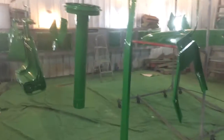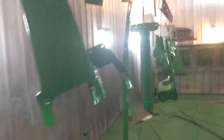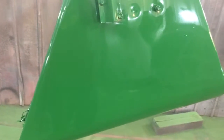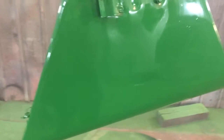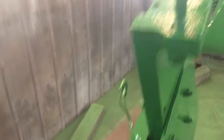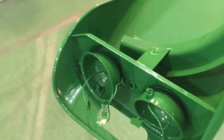At my full-time job I'm responsible for a lot of mills — I read my paint. You're going to spray this John Deere stuff and that first coat is going to go on like gold. You're going to want to say it looks so good I quit, but don't quit. You're going to have to put that second coat on there at least, and that second coat is really going to take some work. Get all your edges — you're not using an electrostatic so you've got to physically get all your edges.